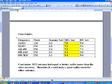Then I tried the upper bands where the local emergency frequencies are. I chose 855.4625 FM — the scanner antenna read 3.1, the MFJ was 3.4, not much better but still slightly better, and the HT antenna was about equivalent to the scanner. Then I tried 855.712 FM — the scanner antenna was again about 3.1, the MFJ antenna jumped up to 5.4, and so did the HT. So they were apparently tuned around those frequencies.